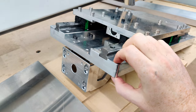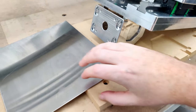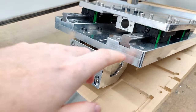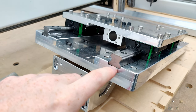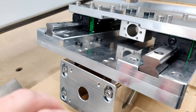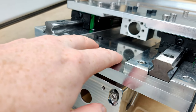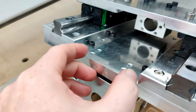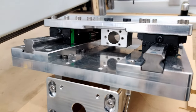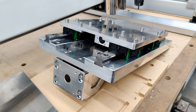What I'll do in CAD is measure down these dimensions properly this time, figure out what my offsets are to work with this material. What I'll probably do is not mill this down to size, because this should be sufficient enough to put the gap in. But then if I make an equal spacer milled for this one, I might have to mill this surface down a little bit just so everything lines up. So I'll jump into the CAD now and go through that process.